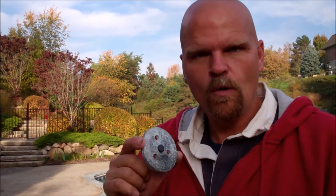This takes the abuse and allows your equipment and your pool to last much, much longer. So if you see this in your yard and you wonder what it is, it's a zinc anode and it belongs in the skimmer. This one in particular clipped to the bottom, but whatever it takes, get it back into the skimmer — it's going to save your pool.